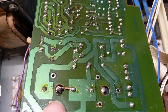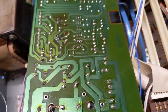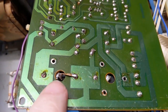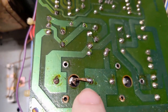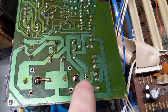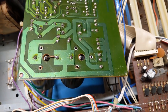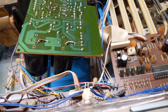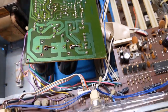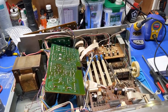The method I chose is I took a piece of soldering braid, trimmed it back a little so it would fit in the hole, soldered it through, then looped it around to create a mechanical connection and soldered it solid. I'm going to do the same thing on the other one, being careful to keep it away from the nearby trace — I don't want to short it. And there we go, both are complete. I've humped this one up a little more so it won't run into that trace — looped it around, formed a solid connection.